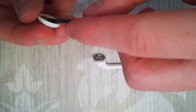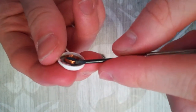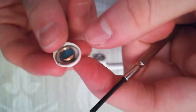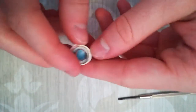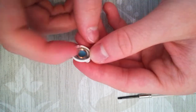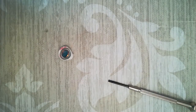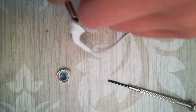And you can hear it's multiple wires because of the sound. Listen. It's not one single scratching sound. You can hear it's multiple. And that's because the more coils you have, the more current can flow through, which allows the magnetic flux to have a maximum change, and that makes it a more efficient electromagnetic conductor.